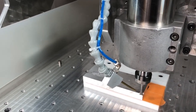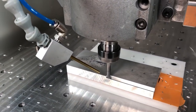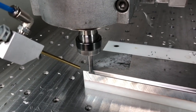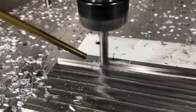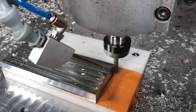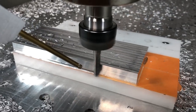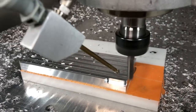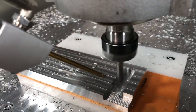For the lower plate I use 7075 aluminum. You'll notice this is not quite how I normally machine — the depth of cut and step-over are rather high. Normally I'm really conservative, but this is 90% step-over with a roughing bit, so I thought let's make a roughing cut. One drawback of a roughing tool is that the surface finish is not quite as good on the side walls, though the floor finish on this tool is actually excellent.